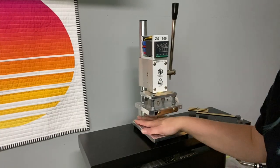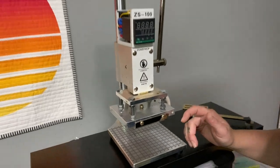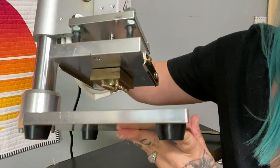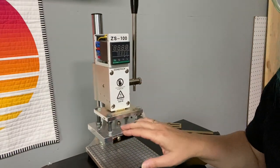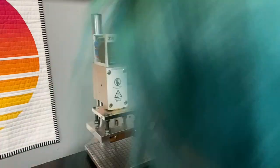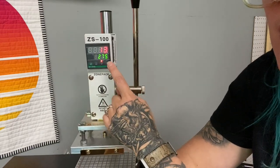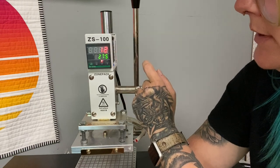This is the heat press I chose — given the size of my hand, this is not a large press. This is the base plate, which has measurements in centimeters, and then there's the heating plate here. Underneath you can see my actual branding head, which attaches with a screw right here. When you turn the machine on, the temperature control box comes on. The green number is what I want it heated to — I have mine at 275 — and the red number on top is how hot it actually is.